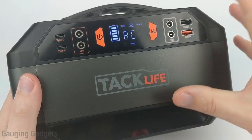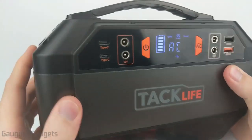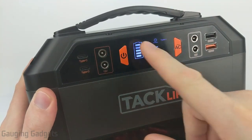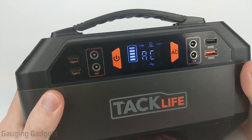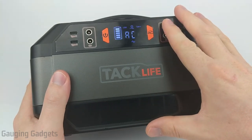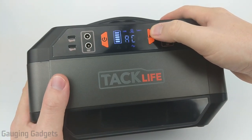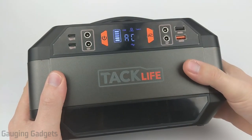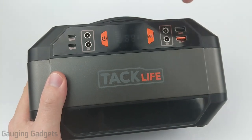A couple of issues I ran into while testing the P30. First, you cannot use the AC connectors while charging the device — if you plug it in, it turns off the AC inverter and only the DC ports will work. You can still charge via USB and DC adapters, so it's a limitation but not that bad. Another issue is that if the AC inverter is accidentally left on with nothing plugged in, it has no automatic timeout — it will just stay on and slowly deplete the battery. You want to get in the habit of turning off the AC inverter when done, or just turning off the device entirely.